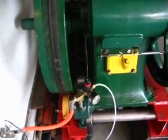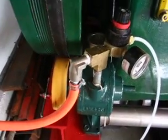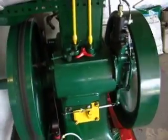We will turn on the fuel and proceed to start the motor. First we're going to turn on the air starter, then turn on the fuel, we will release the decompressor, and the engine is running.